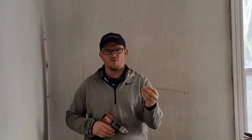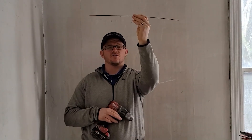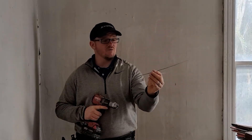They're used to hold up insulation. You can get them in 24, 18, probably 16 inch sizes. What they do is when you install insulation in a home — underneath or anywhere in the walls — and you want it to hold, you'll literally push this up, it squeezes in between the two rafters or floor joists and holds the insulation. But what we use them for in the rewiring world is we use them for flags.